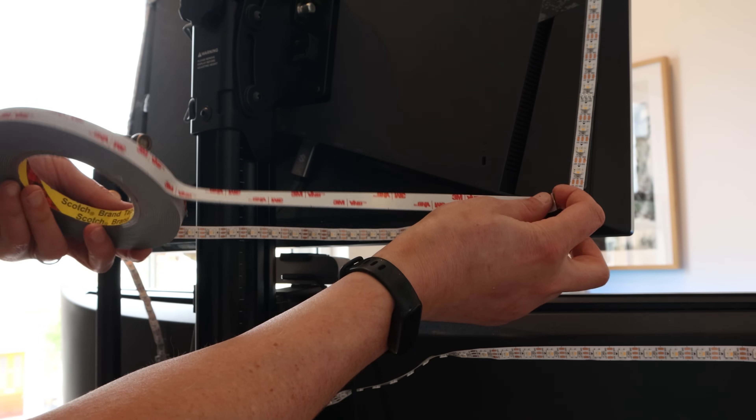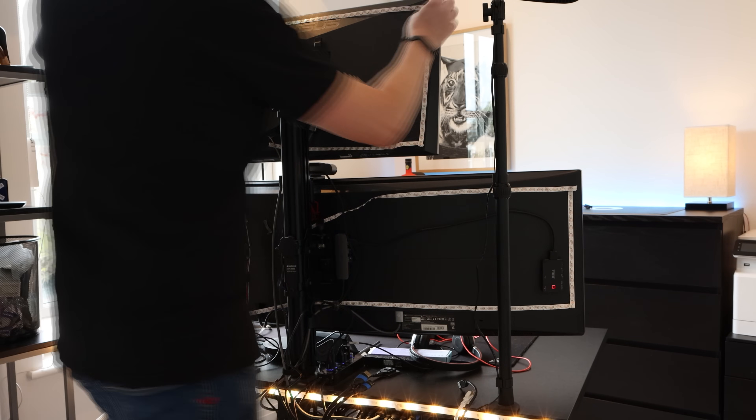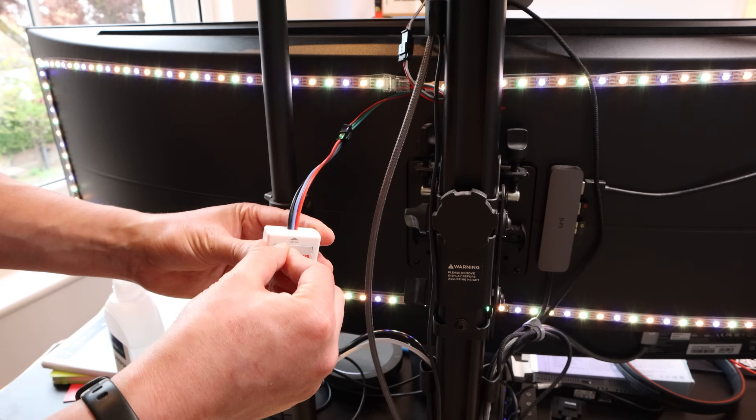To fix my monitor setup, I pulled the old Dig Uno controller and re-stuck all of the LED strips back up using the new VHB tape. I then cleaned the area of the monitor where I wanted to mount the controller with isopropyl alcohol, wired up the Dig2Go controller, and reattached it using the same VHB tape. Et voilà — problem solved, and I learned about a whole new category of entry-level WLED controllers. If you found this video useful, I'd really appreciate a thumbs up. I'm going to be making more of these lessons-learned videos, so hit the subscribe button and together we can make your home smarter.